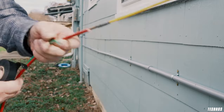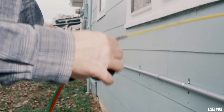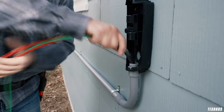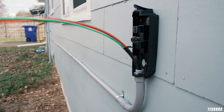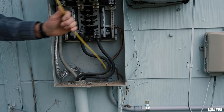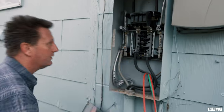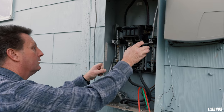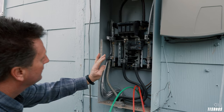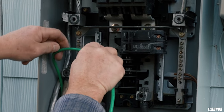Sometimes you can have different colors so you have a better idea of which is L1 or L2. Supply is limited right now and wire is a lot more expensive than it used to be. Once you have your two red wires and one green, bundle them with electrical tape and make it tight — it helps to have someone assist. The conduit is pre-coated so it's very slick and easy to feed the wires. Once they reach the end, unravel the tape. Then install the 60-amp breaker — you get 48 amps of actual output. Measure your wire carefully for clean cable management.